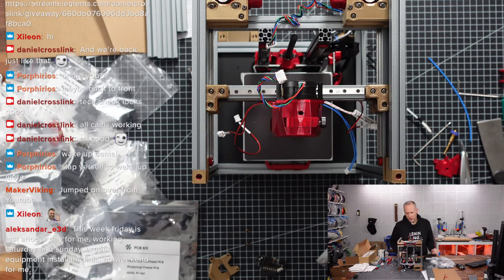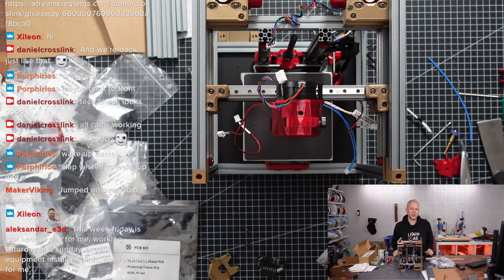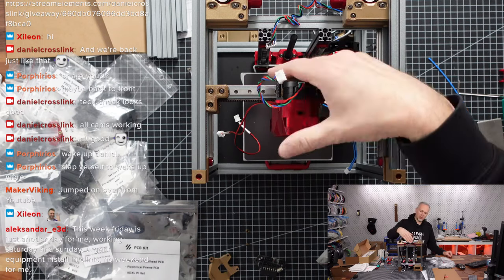Also, when looking closer, I realized that the belts sticking out of that mount were covering the hot end a little bit, also the heating fins, so to say. That probably means the airflow and the cooling would be influenced negatively. Combined with the fact that the whole assembly was pushing against it and not perfectly perpendicular because it was slightly tilted, and the belts were blocking it from going flush on the surface of that mount,